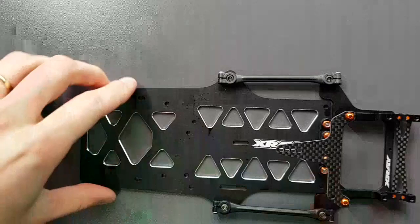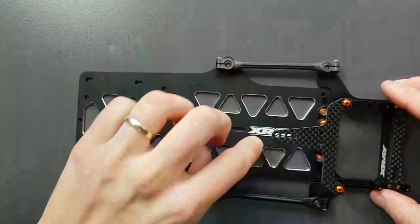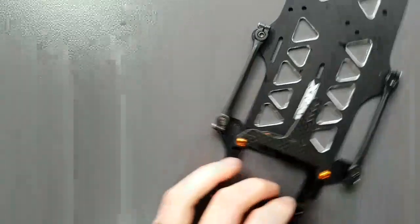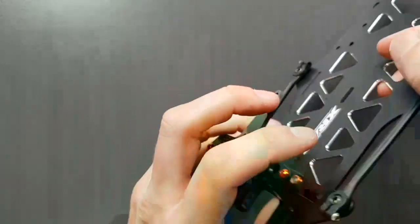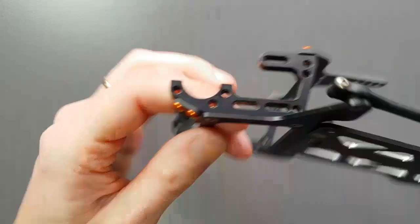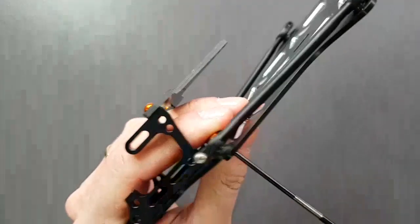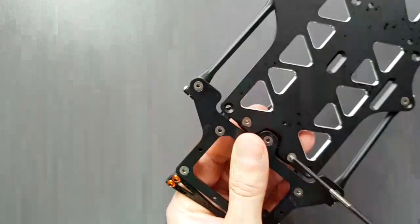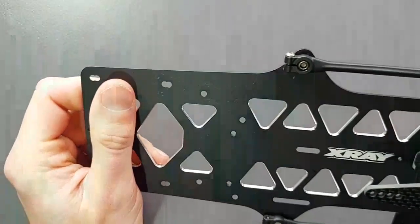Once you've got the side links mounted, make sure it's moving freely and make sure it's flat. Then comes the tricky bit: you need to make sure you have free movement. Basically what I do is I shift this back and forth a little, let it fall into its natural position, and tighten the screws down. You keep doing this until you have free movement. As you can see right now it's not free, so I need to look for the optimal position for free movement.